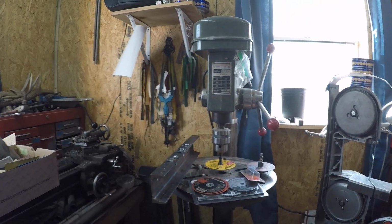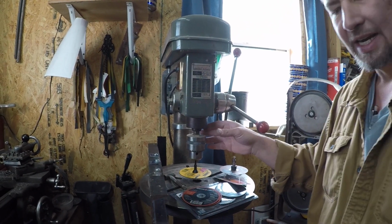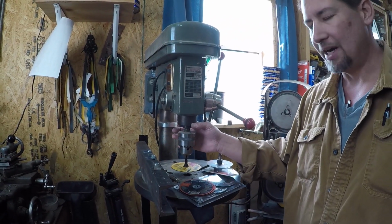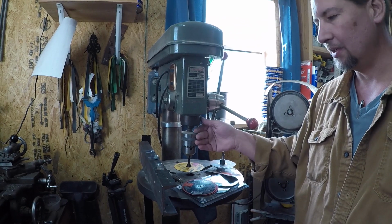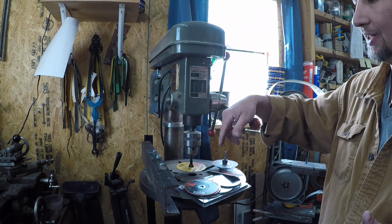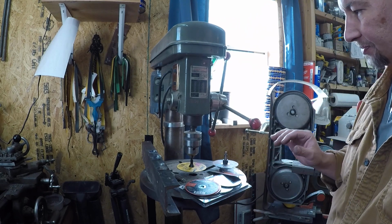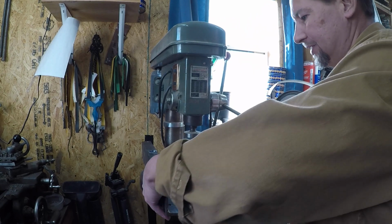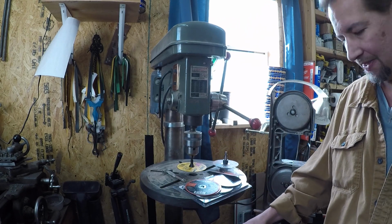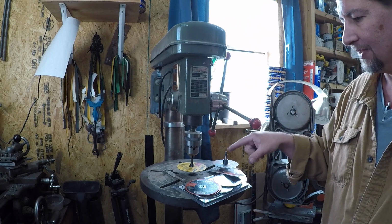We'll just swap spots here. So anyway, a drill press is not really meant to be used as a milling machine. Now, a big, heavy, old school drill like this one has larger bearings, and so it can handle a little bit more sideways torque, but they're really meant to go straight down and then straight up, and that's it. But these are very, very light cuts, so this won't hurt the drill press at all. So anyway, on the next one, I'm going to go ahead and clamp up some blades in that milling fixture, and then try it that way.